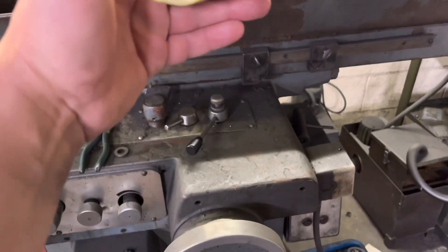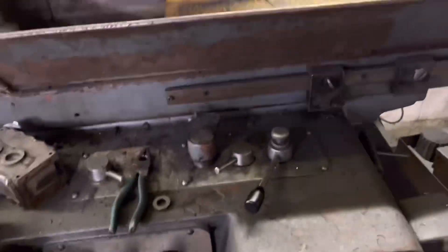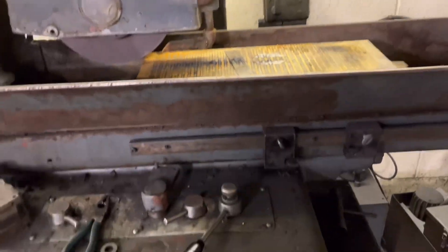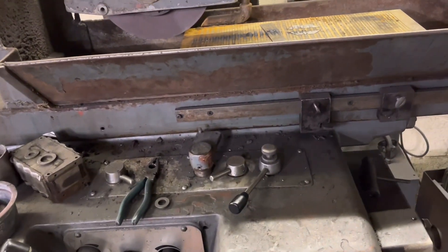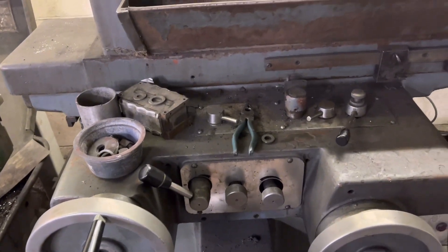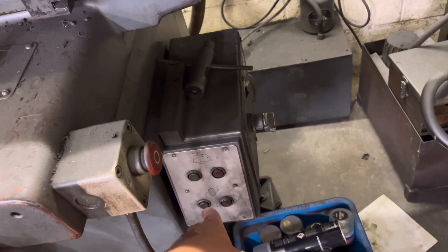This one here moves the table in manually — clockwise is moving it inwards, anti-clockwise moving it outwards. I tend to use that for doing shims. I don't use the automatic feed because it's a little bit vague being fluid-worked. Normally I do it manually so you know how much you're moving it in — on shims it's fine. But if you're surface grinding anything with a big area I tend to use the auto. This other one, if you push it in, moves the slide manually forward and backwards. You've got the wheel start and stop up there, and the pump for the feed down the bottom.